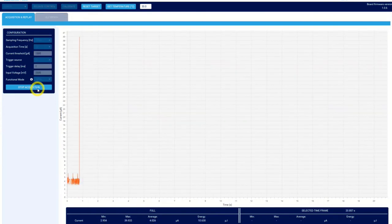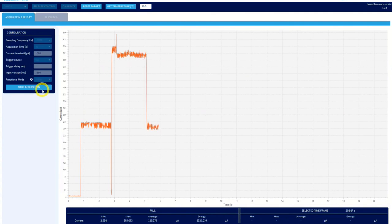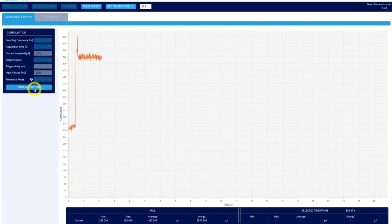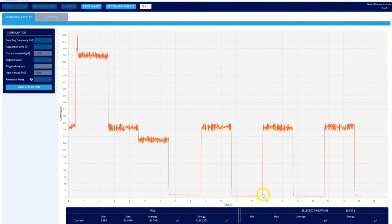I'll do a new measurement. Press the reset button, and now we have here the LDO phase mode, then SMPS, then we switch off the flash bank, then we get stop mode, and then we wake up again. Up to this point here is interesting for us, so we stop here before it goes off screen.